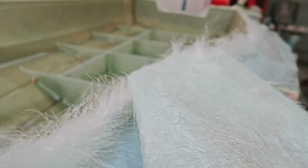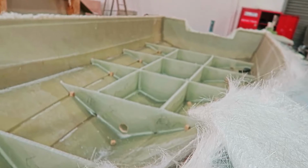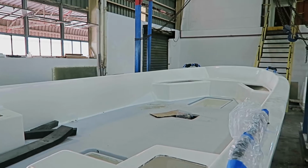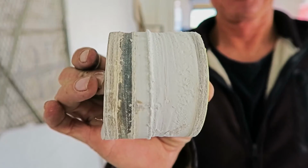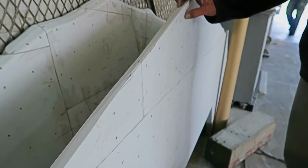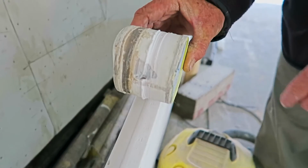And the beautiful thing about it, the problem with wooden transoms is that polyester resins don't like to stick to timber because they're not adhesive, they are just a binder. Using the composites adhere better with the polyester resins than timber, and you don't have the rot issues. This is how thick the transom is on the 17. That's your gel coat.